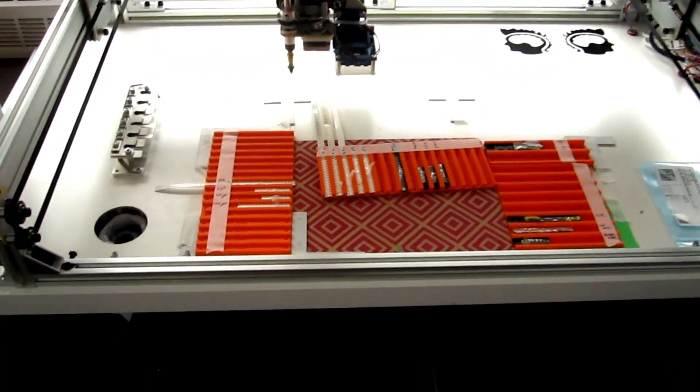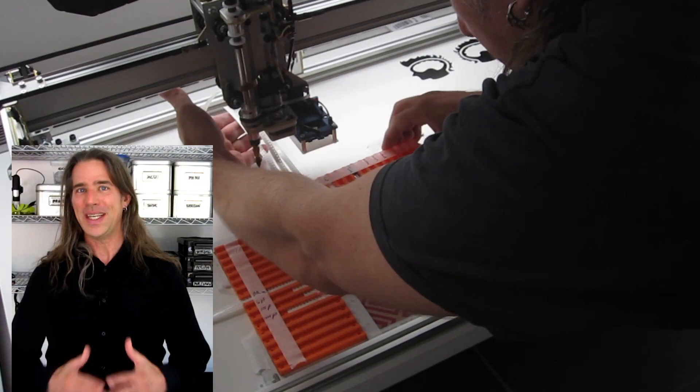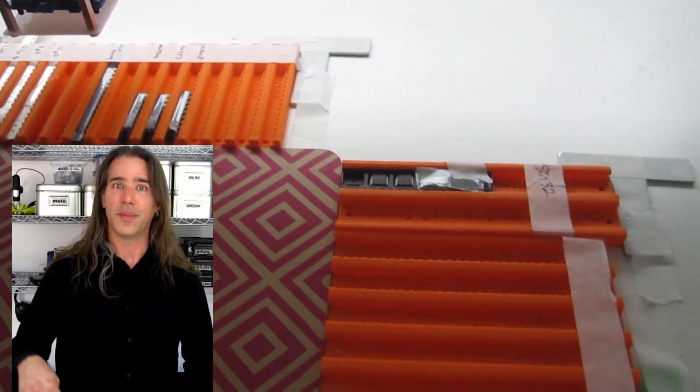As a way to keep the lighting steady, when it's in use the pick-and-place sits nicely below a standing desk. This isn't the very first run for this specific PCB, so the feeders are already all set up and it's just a matter of sticking them back in their spot. This is easy because I use little T and L brackets stuck to the table and I can just slide them back into the exact same spot. I refill the holders and slide them back into place and the configuration is steady for the duration of the runs. This project doesn't have many parts, but I still use different feeders to separate the 0402s from the bigger parts. I arrange them in a circle to try and minimize travel getting the parts.